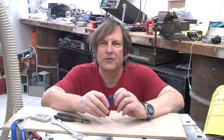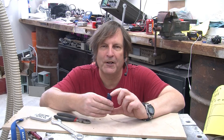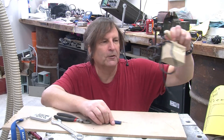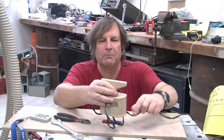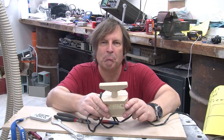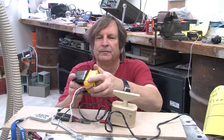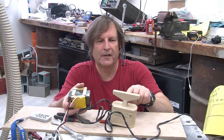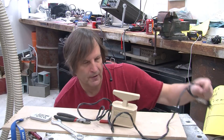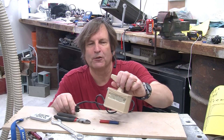A way better way is to use AC — an alternating magnetic field that gradually diminishes in value. A few years ago, meaning 20 or 30 years ago, you could buy these things. This one apparently came from Radio Shack. It is a bulk demagnetizer. All it is is a coil inside a nice plastic housing, attached to AC power.